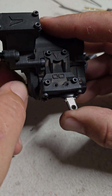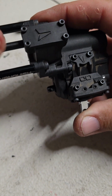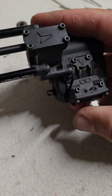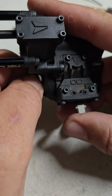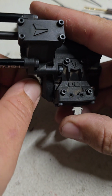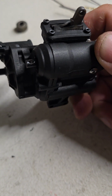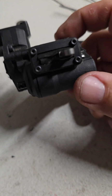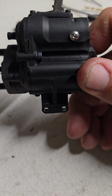It works just like the rear dig, so that's locked up. And go forward and engages. Go back, just like the rear one. A little bit of pressure on the shaft and it'll fall into place. Now it's locked up, won't go anywhere. So there it is. So we can do dig on that without buying a bunch of parts and waiting on stuff. And there's no reason why that's gonna ever let go.